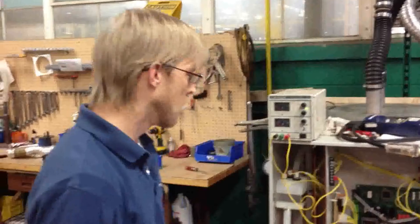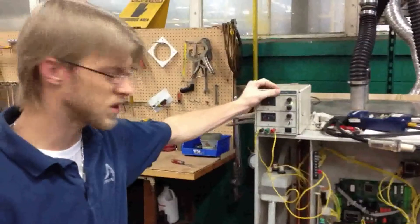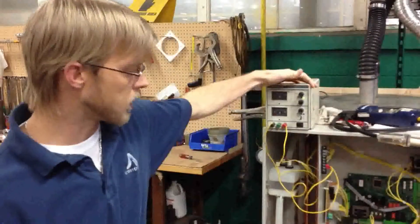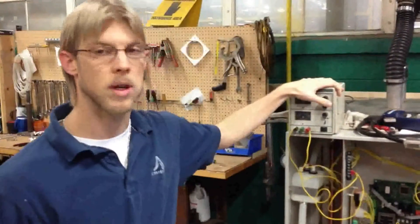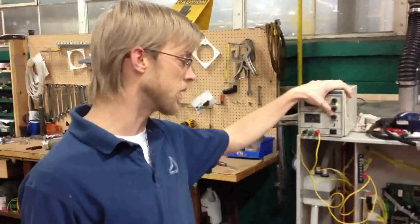Right now this unit has been powered up. It's already been through its five-minute warm-up after initial power-up — it goes through a warm-up and there's nothing you can do about it. We've hooked up a signal generator just to give you some basic functionalities so we can run this thing. The very first thing after checking all of that — of course check your plumbing, make sure all your plumbing is correct. You'll also want to look at your steam dispersion piping, make sure that's all correct, as well as your flue piping.